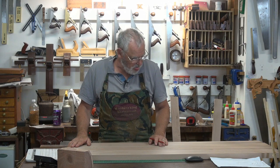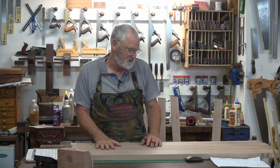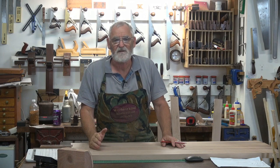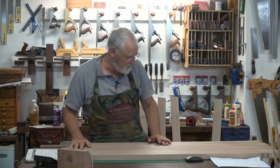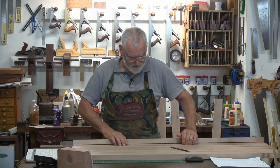They've only got to be four wide, haven't they? Yeah. I've gone through the boards and selected a colour match. So the colour matches. Then I've got all the grain going the same way. So the chatoyance is going to be the same. And even though I've lost some absolutely beautiful, brilliant book matching effects, I'm going to have something that is just going to look right, I think, and look nice. So I've got to rethink this. Oh, hang on, that's it. These two can come off. They've got to be 240. I think by the time I finish gluing up, these might be a tad thinner.